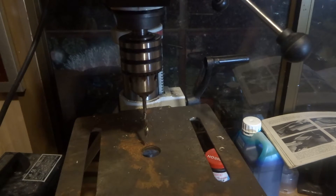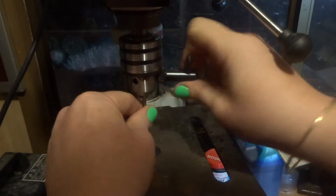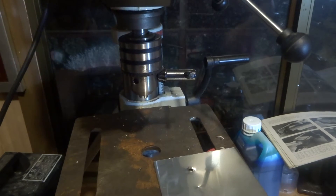I'm going to do two at a time so we don't have to worry about scratching the outside surface with a file. This will be the outside and I want to keep it nice and shiny. So we'll just deburr them as we go with the step drill from the other side.